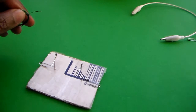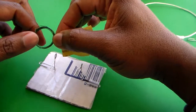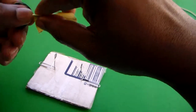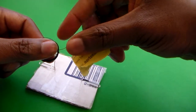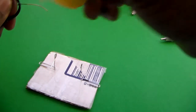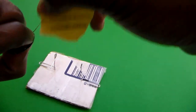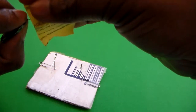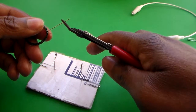What you want to do now is take a small piece of sandpaper and remove the coating on the outside of the magnetic wire. You want to remove that coating with the sandpaper, just keep sanding that edge off — try to get off as much of it as possible. My magnetic wire was coated in a green insulation, so once that green insulation comes off, you'll be able to see the copper-colored wire underneath. Get as much of that off as possible. This end seems a little bit long, so I'm just going to cut it just a little bit at the edge.